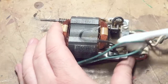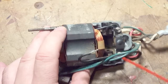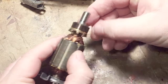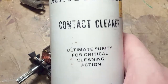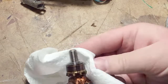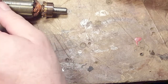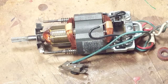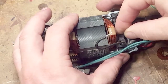Now we go back to the motor — I'm cleaning off all the dust, tons of sawdust. The air can gets rid of a lot of it. I've got to replace the rotor, and I'm using contact cleaner — bought this at Active Surplus on Queen Street in Toronto, that place is gone so I don't know what that stuff is anymore and it's not replaceable. But it's good stuff and cleans the contacts well. Now I've got to put the brushes back in — this is a challenge.